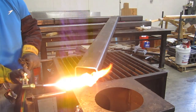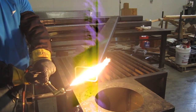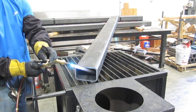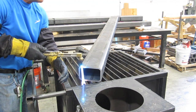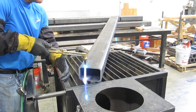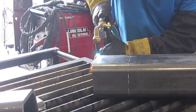About ready to cut, so we're firing up the cutting torch. Adjust the acetylene until the smoke pretty much goes away, right before it's about ready to jump off the tip, so I can get the most out of the tip. Making a decent cut has a lot to do with using the right size tip. You can use one that's too big and go a little faster with a little wider kerf, but it usually does not do as good a job or make as square a cut as the proper size tip. Ideally I'd have another piece of metal the same height as what I'm cutting, but I'm just improvising here.